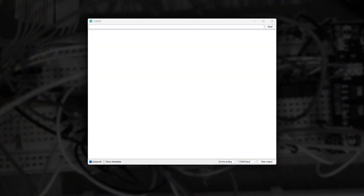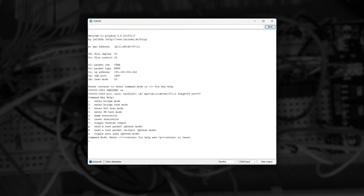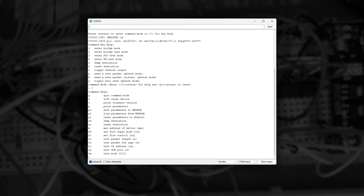Now it's successfully programmed, we can connect it via the serial port using a baud rate of 57600. Upon connection we're greeted with a confirmation message — this means the firmware was successfully programmed onto the device. We're currently in active mode and if I send a question mark we can see all of the options available. If I send a blank line, the device switches into command mode, which gives us a whole load of extra options we can play with if needed. We'll come back to these later if we encounter any issues.